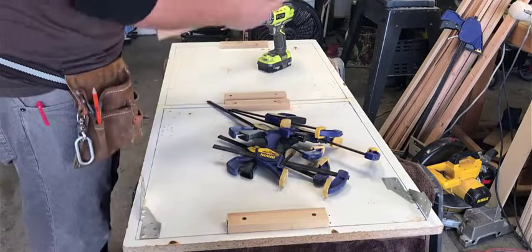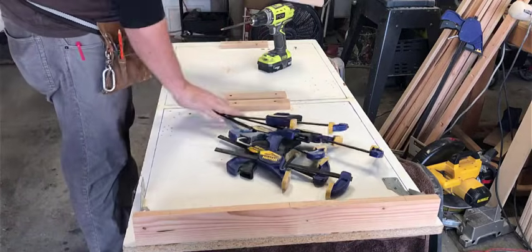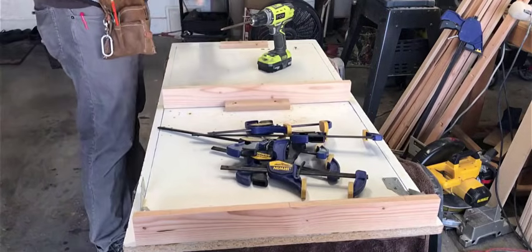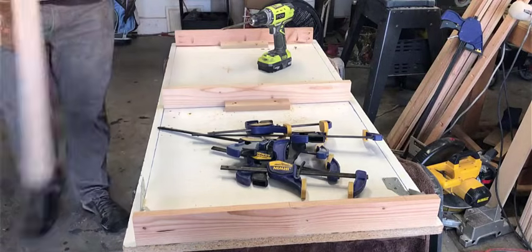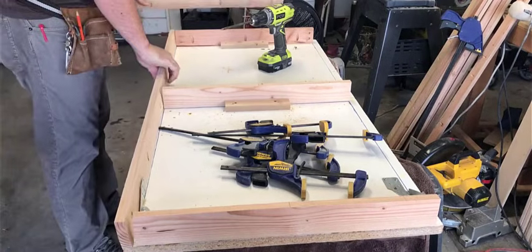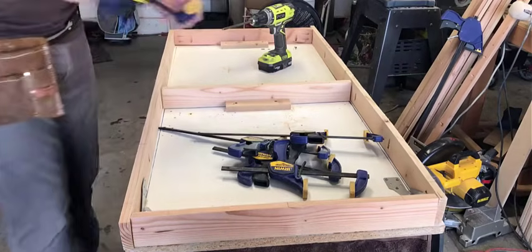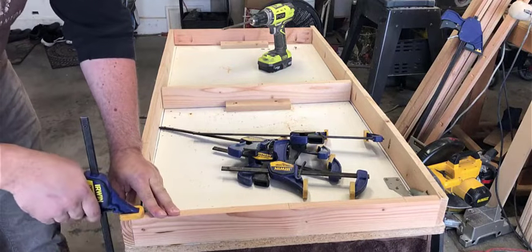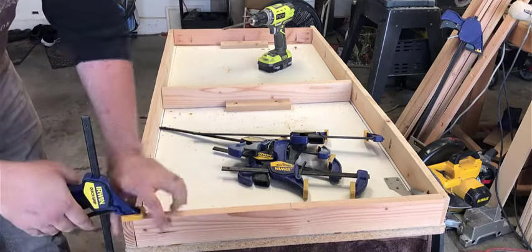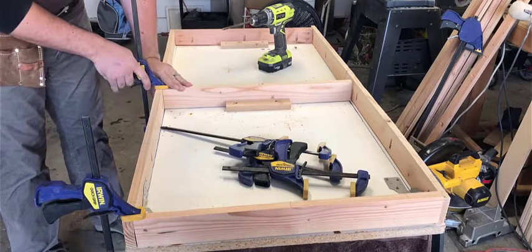All right, the next step is going to take all of your cut and pocket hole drilled pieces and then attach those and assemble your frames. So I like to use this jig that I made up. It's the size of a cornhole board, 2 feet by 4 feet, piece of cheap MDF, 3/4 inches. And I have these blocks screwed into it, a couple little angle braces, just to help me place those boards so every frame is exactly the same.